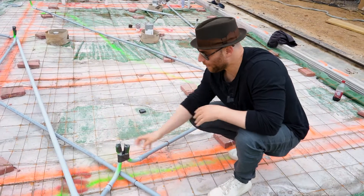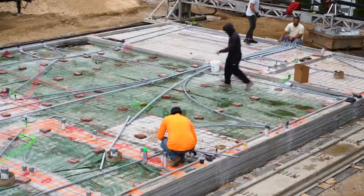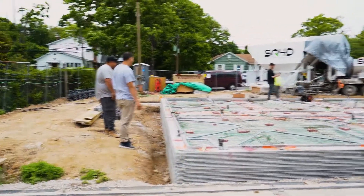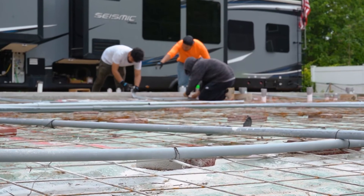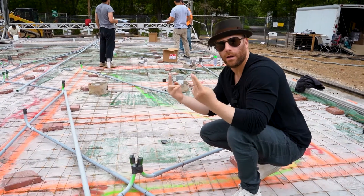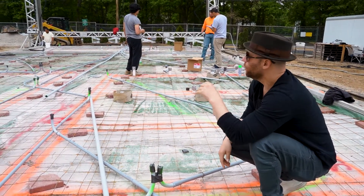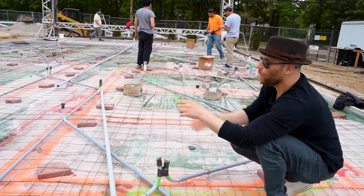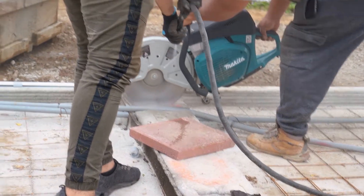Perhaps the most interesting part of what we're doing here is the electric system. My team is running conduit all throughout the house. The electric is going to be encased in the concrete slab, so we have to plot out exactly where all the outlets and lights are, and we come up from underneath. The conduit gets laid out, and later the electric wires get threaded through it, coming up where the boxes are, ready to go. As you pan out across the house, you can see exactly how the electrical plan is laid out and where everything comes up out of the wall. We cut little grooves where everything fits through for the exterior walls — a perfect setup.